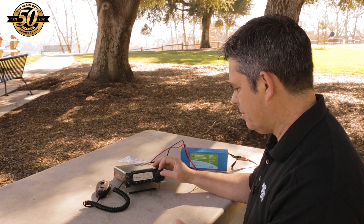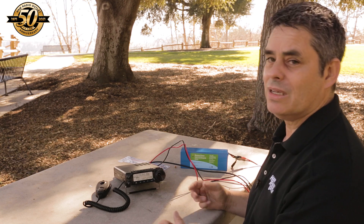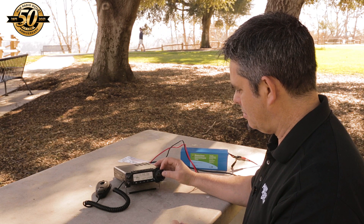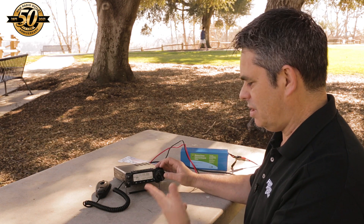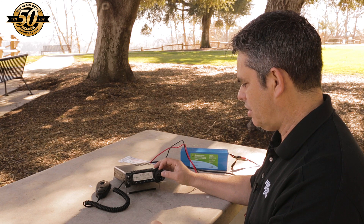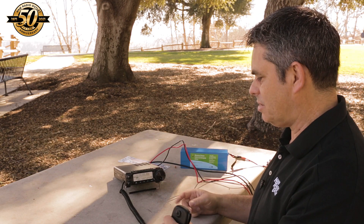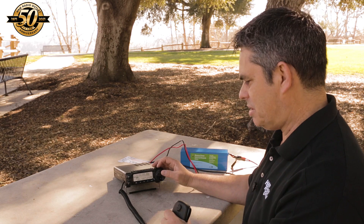Just booming in. It's Super Bowl weekend. So let's find a quieter frequency and put out a CQ — or at least see where the SWR is. I've got SWR showing here right now. 14.235 sounds clear. Close enough. So as we can see, it's below 1.5:1, as we expected from the antenna analyzer. That's good. Let's find a good frequency and put out a CQ and see if we can get somebody come back to us.